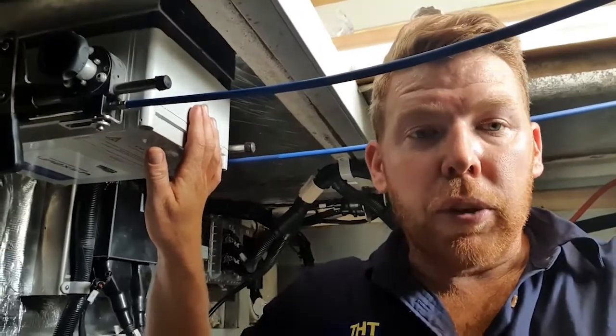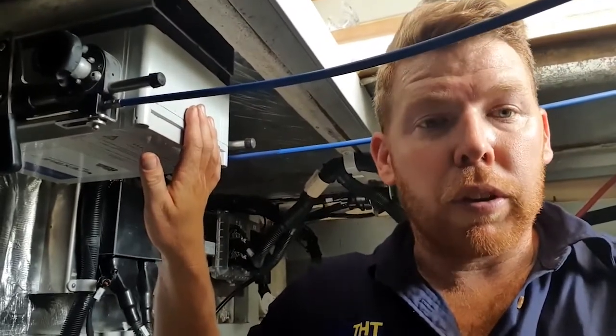It's a multi-volt system so it requires anywhere from 9 to 32 volt input. I'll take you upstairs and show you the throttle control system up top. They're a very simple system to set up and calibrate in regards to the position of forward, neutral, and reverse on the gearboxes. These NEFs feature CAN bus throttle input, but we also have the option of a 4 to 20 milliamp, a 0.5 to 4.5 volt system, a pulse width modulation or PWM system, or otherwise we can tailor something to suit your requirements. Flexball are very good at being flexible in regards to what they can offer you.